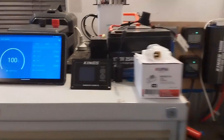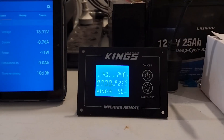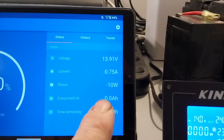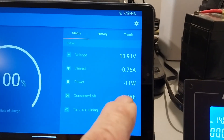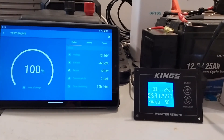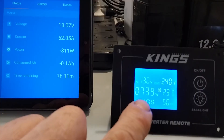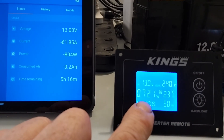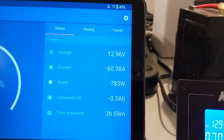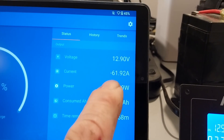Right, let's do it — let's get this test underway. Cranking our inverter on, we can see the current draw on that inverter: we're pulling 10 watts running it on idle. Coming over to the heater and turning that on — we're just going to run it on low, not high; we don't have a big enough inverter or battery for that. We're pulling around about 700 watts roughly, and we can see we're pulling just shy of 800 watts out of our battery — just over 60 amps.